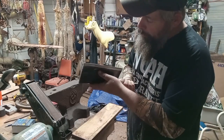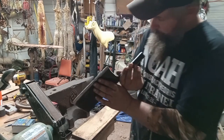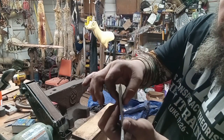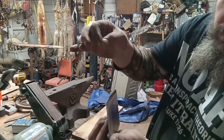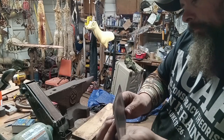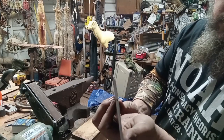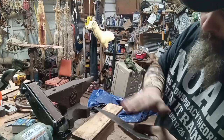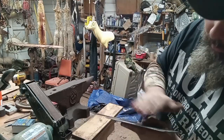So we got her going down pretty good. It's just a thick blade, comes down, goes off to a taper real fast — that's what you want for a chopper. What we're going to do is get the file out and go ahead and keep taking some of this metal off.